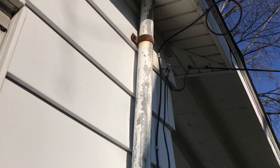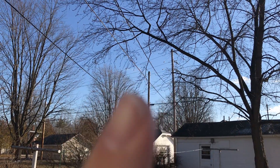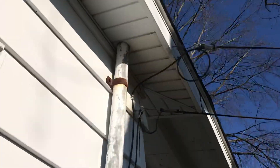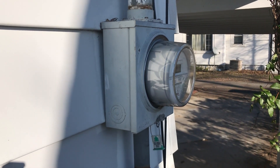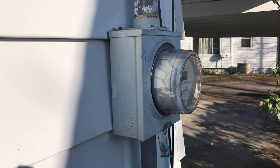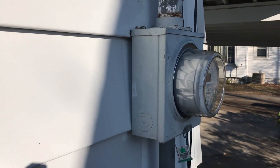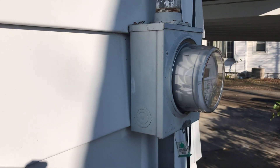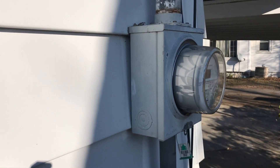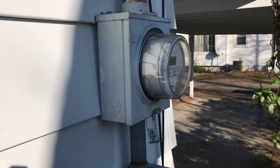Here's our current 100-amp meter box. They'll go down under there, and what they're going to have to do is pull a new line from here all the way over to that pole right there — that's step three, the last part we've got to do. So to recap what we've shown you today: updating our 100-amp meter box to 200-amp, updating lines to our remote garden location, and five dedicated 20-amp breakers just for mining. This is Wes — not your normal miner.